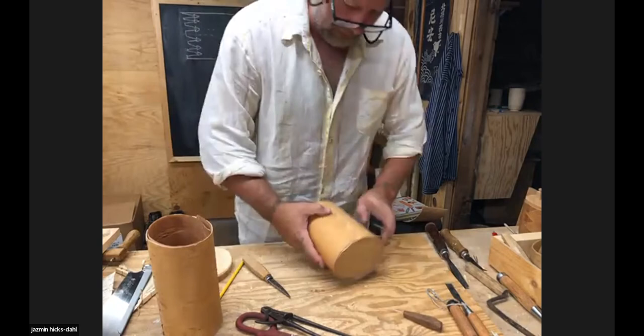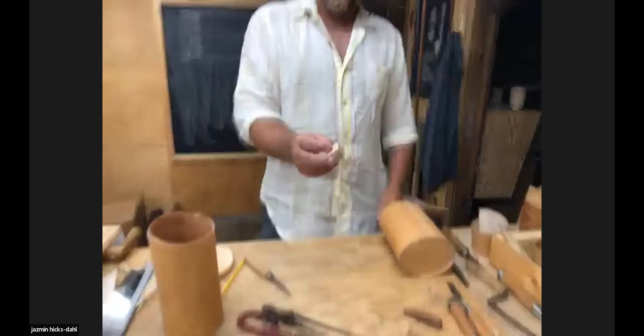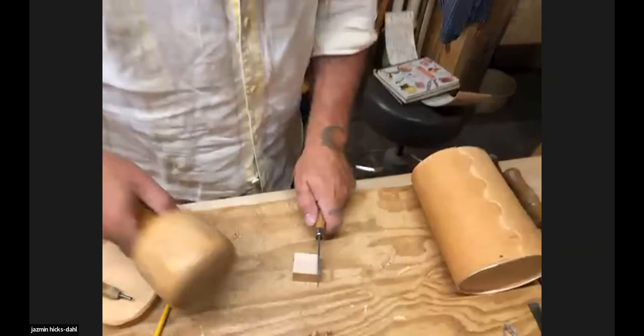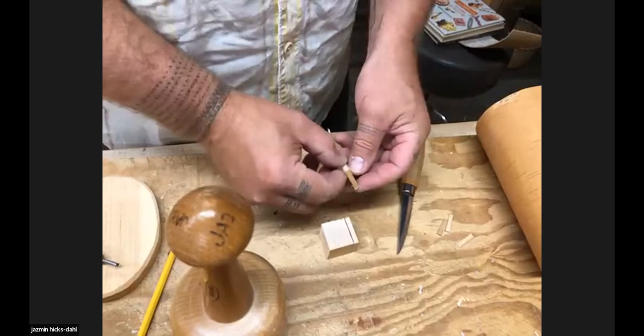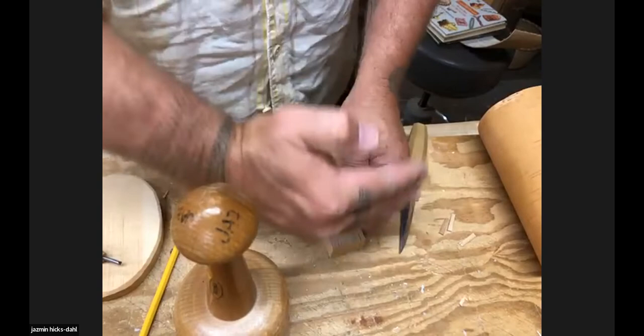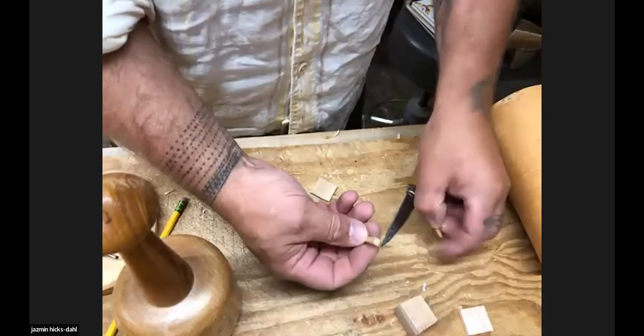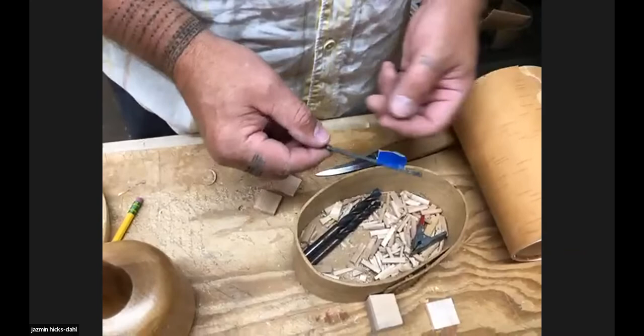And then you need to make some pegs. Take a block of hardwood like birch. It's end grain, so the grain's running up, and you can chop. Or if you take a rubber band and put it around there, then they'll all stay together, and then you can just chop, chop, chop. So make a ton of pegs. So here's my little box. I got a twist bit that's set up the same as that handmade drill. And then I got all of these pegs that I just made.